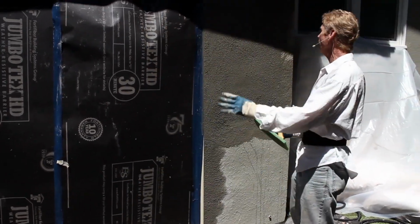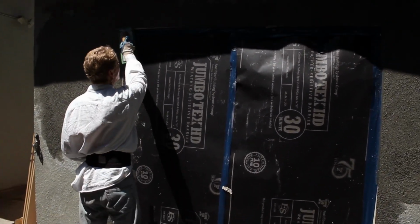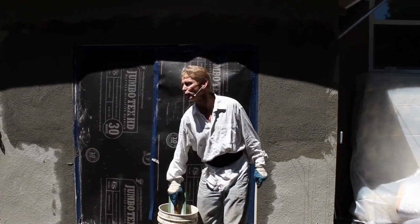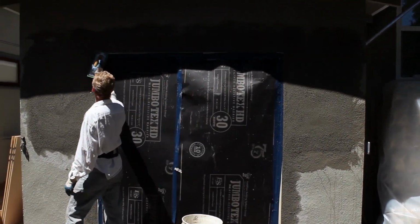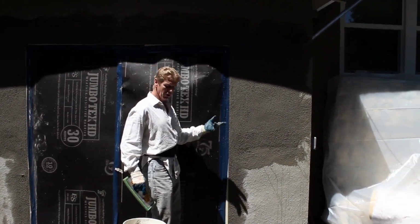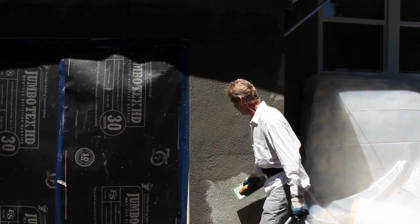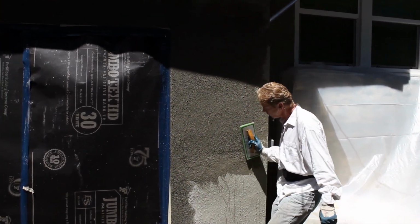Okay, now here's what I'm doing. Now I'm looking at it and thinking, is this passable? Okay, clean this tape. Why do you clean the tape, guys? I'm not cleaning the tape for looks of the tape. I'm cleaning the tape to clean the edge because I'm getting ready to pull this window. Now I clean the window, the tape rather. We clean it because again, I'm getting ready to yank this off. And if I leave all this stucco all over the tape, what happens, guys? All you plasterers who follow me or you render guys in the UK know what'll happen. That will tear the stucco off. We don't want that. All right, we feather in real nice.